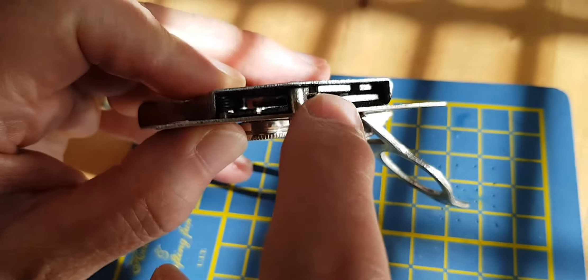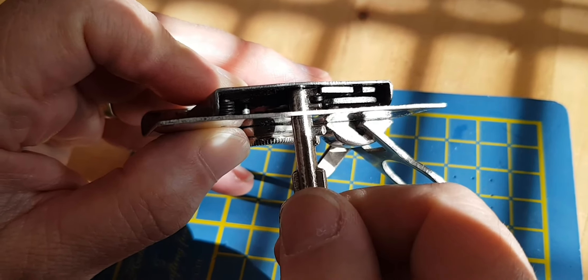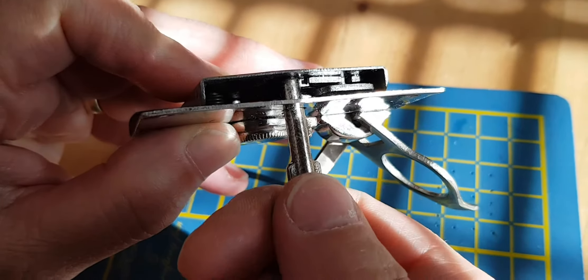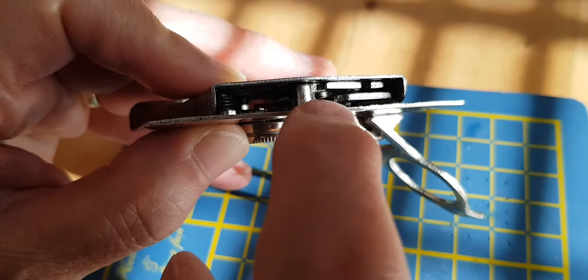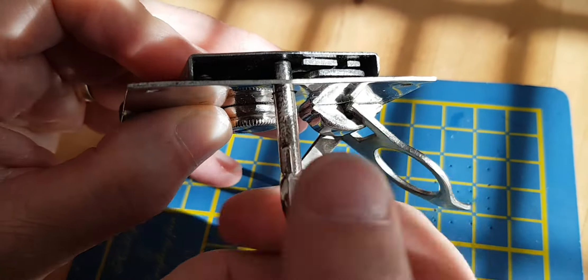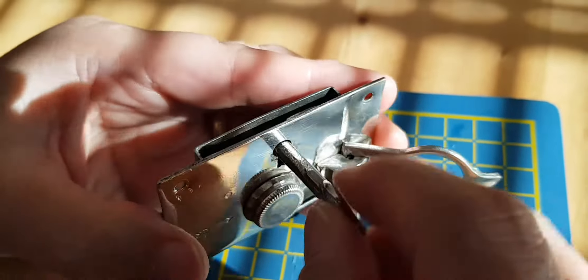I could see that the ward has to move the plate at the back, and luckily with this key it only just makes it because it's quite short — it needs to be a little bit longer. You can see it moving up and down there. I did gently file a section of the middle of the key to make it work.